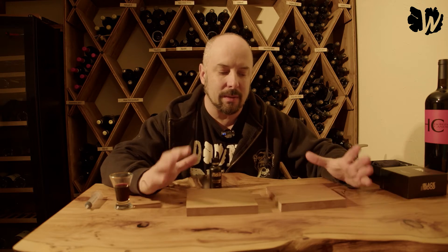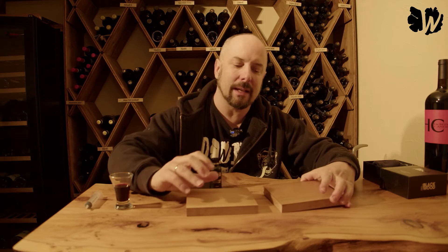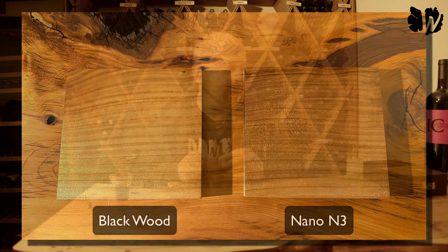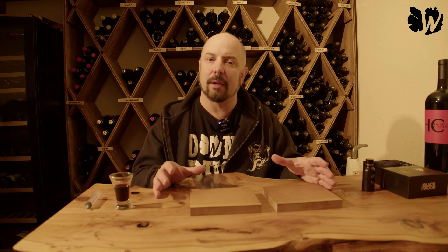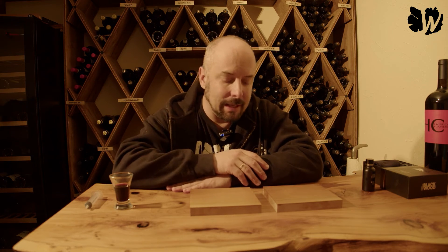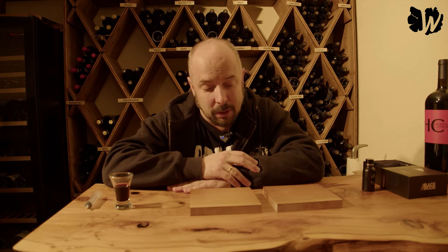These two boards here — one is treated with Blacktail N3 and the other with Blackwood. Optically I don't see any difference; they're both nice looking with a similar sheen. I'm going to test this the same way I did for the N3: put a drop of red wine on it, wait a minute, then extend the times and see how the wood protection holds up. The main criteria is how well it protects against liquid, and second, the pricing. Right now I don't even know if the Blackwood is any good, so let's go ahead, put red wine on, wait a minute, clean it up and see how it looks.